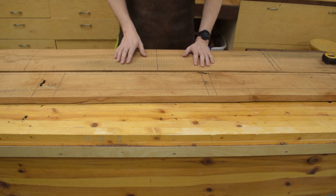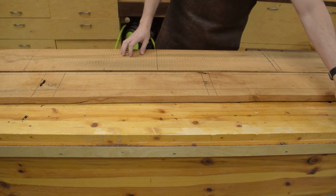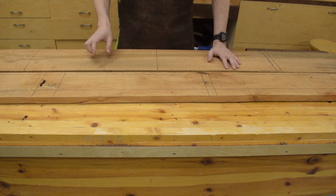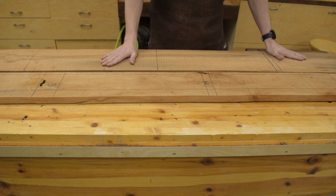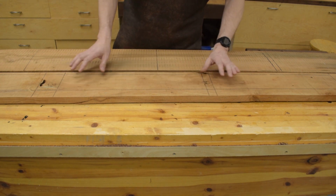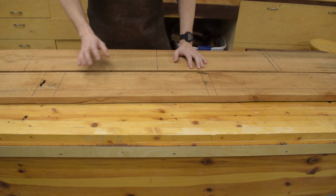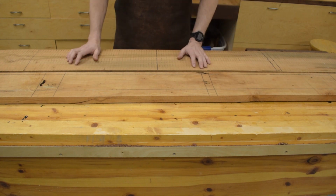And I compared that to this board up here where I have no knots, no voids, nothing that I would need to worry about. But what I do have is some blue staining from some nails. There's some cases where I think that could look pretty cool, and I think I'm gonna save this board for those cases, because in this case, with such a small drawer front, I really don't want to make this any busier with something like this blue staining that completely changes it, especially when I'm already matching these cherry drawer fronts up with the walnut mantel.